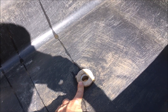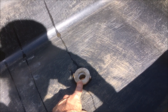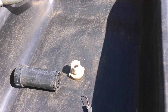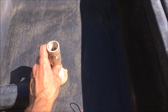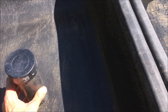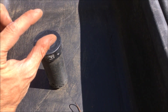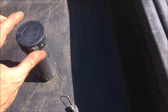This piece right here is called a bulkhead fitting and this is what keeps everything watertight going from inside the tub to the outside. Once the bulkhead fitting is on, I'm gonna take this little piece - this is gonna be what's called the standpipe. The water is gonna fill up to this point and then it's gonna start going down this opening. I'm gonna put this piece on top of it so once the water starts filling in through there, there's gonna be a little bit of air trapped in there.